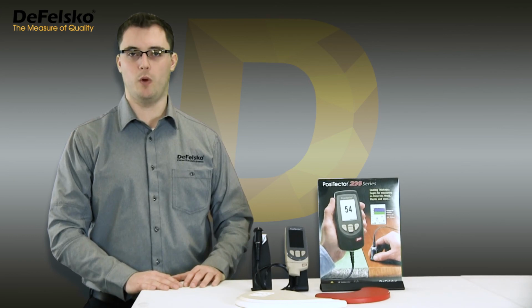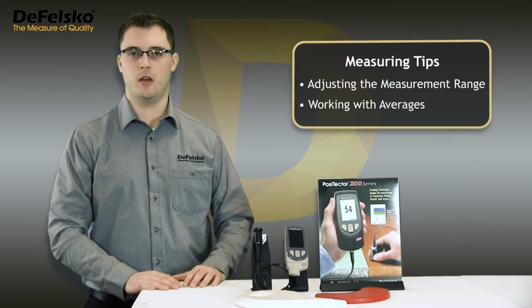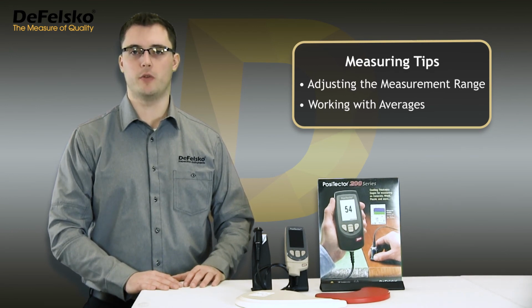To recap, when measuring on rough surfaces, raise the low range value to not more than half the expected coating thickness, and use memory to average a series of measurements. These two simple steps will provide meaningful thickness measurement results on coatings with rough surfaces.